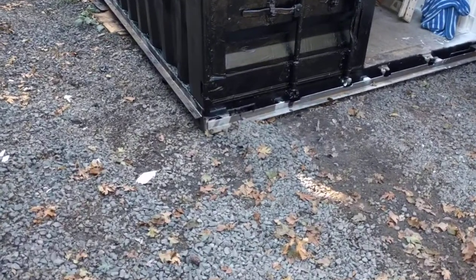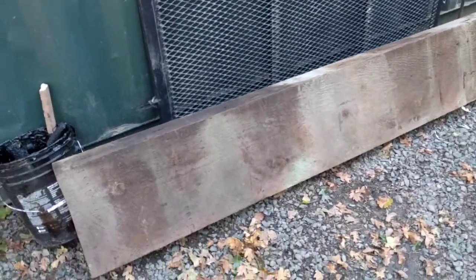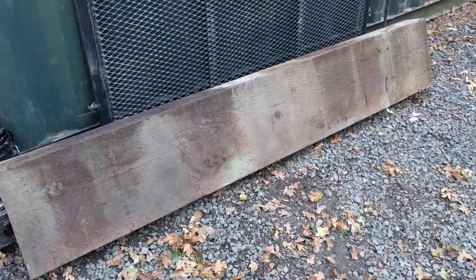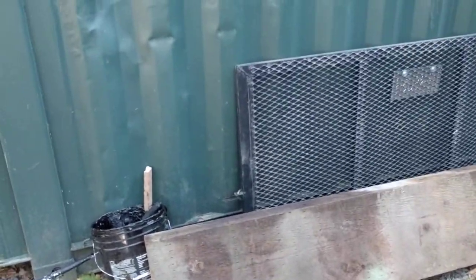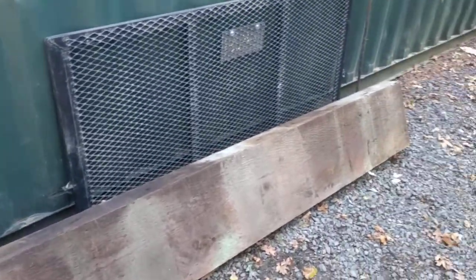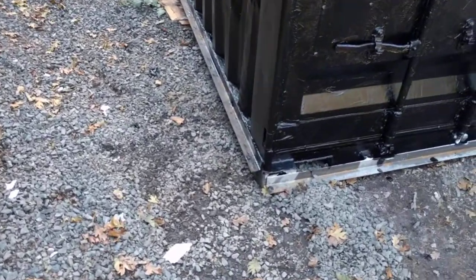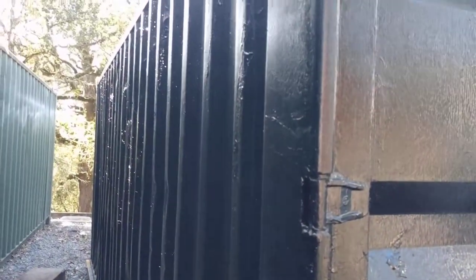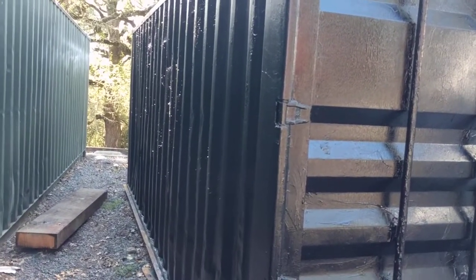These rails along the bottom I had welded on. The rails are there to hold bridge sections — I bought a bridge from the county almost a year ago now. These are 16 by 6 inch sections, about 25 feet long. I've cut these to length so that the edge of them will go directly on these little shelves here, and then they will stand upright against the outer walls of the container on all four sides.